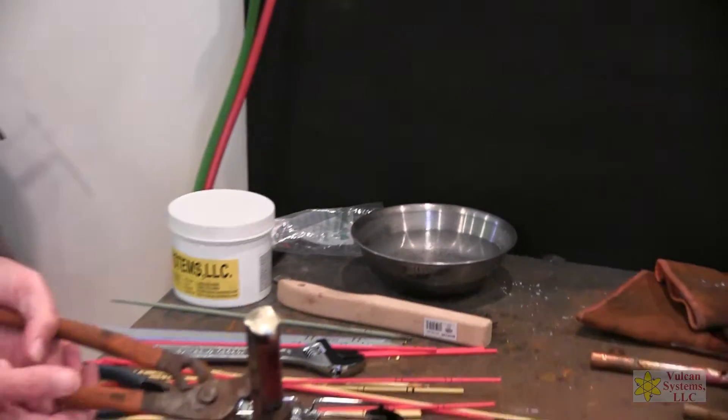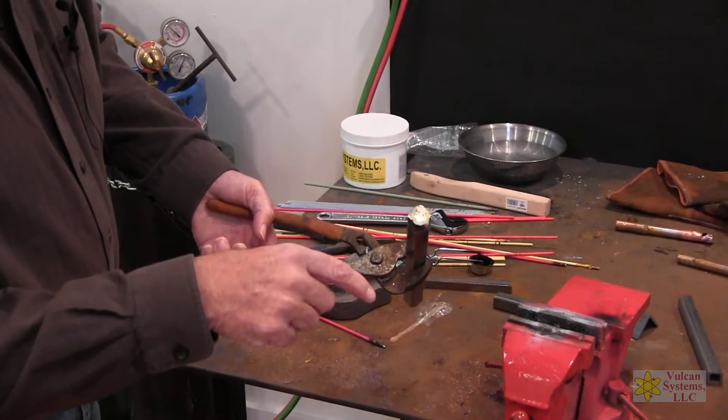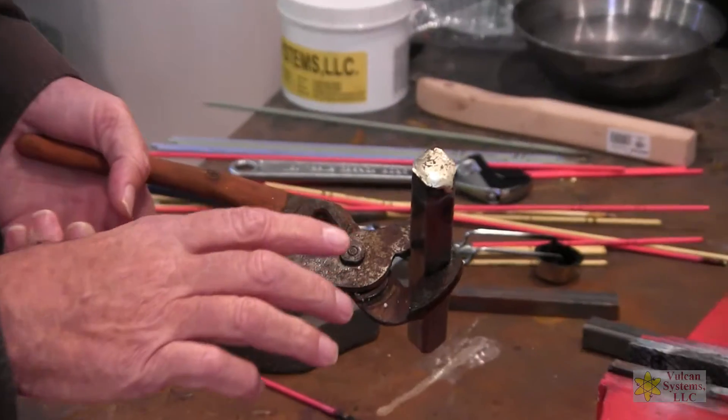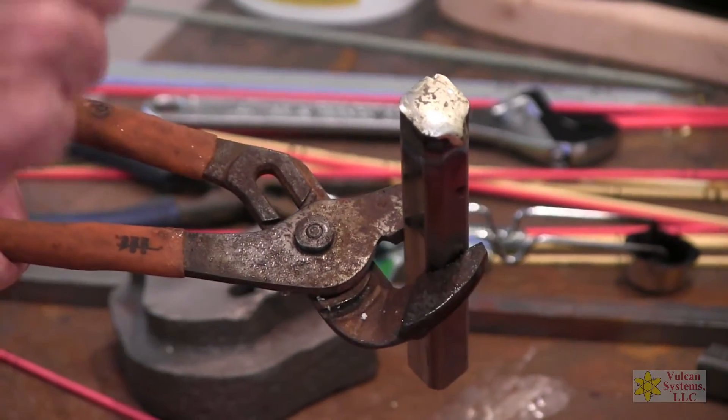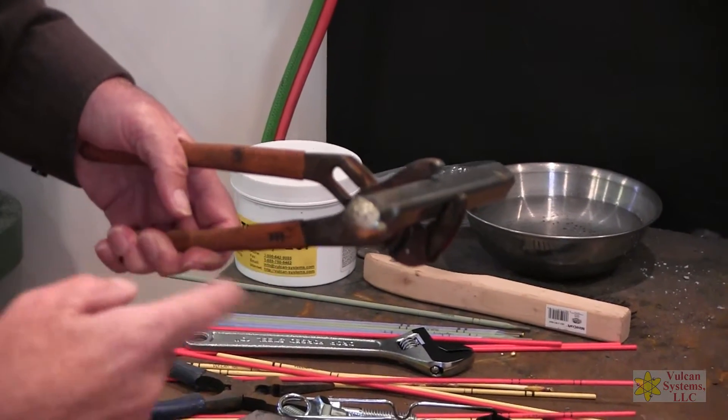What you see here is a real nice fill with nickel-bronze combination. You'll notice it's got a little silvery color — that's the nickel. You could also fill a hole in, drill a hole, and have a bushing, because it work hardens.